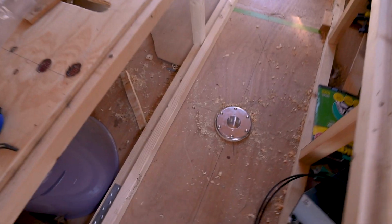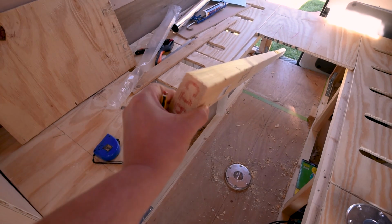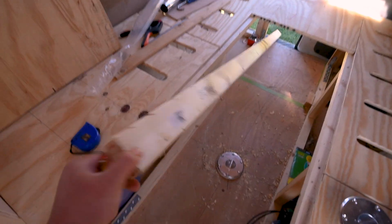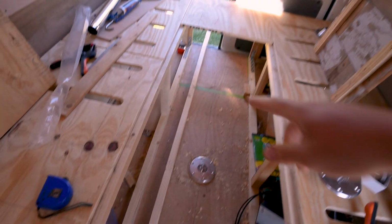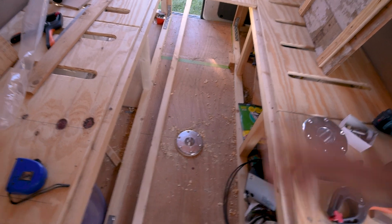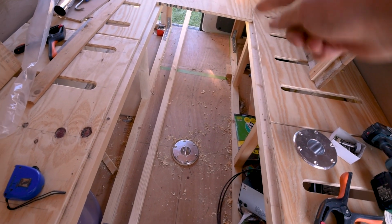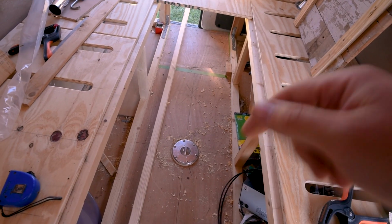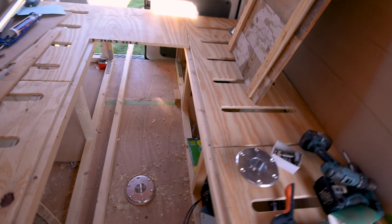To raise the floor, I'm going to use some of this stuff, what's it called? CLS stuff. I'm going to use some of that, which I think is 2x4. Stand it on its side, and I'm going to go along around an edge, and then I'll put some ribs in like I did the floor, and then I'll find out where the holes need to be and drill them. I might even insulate it again as well for extra sound deadening.